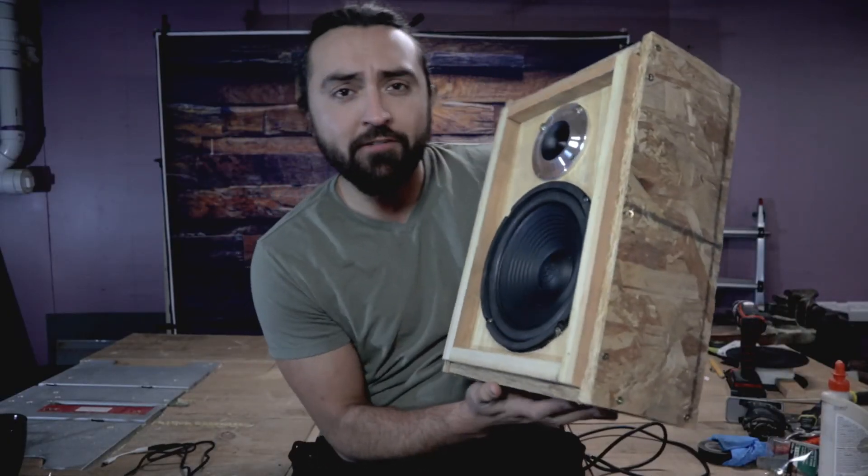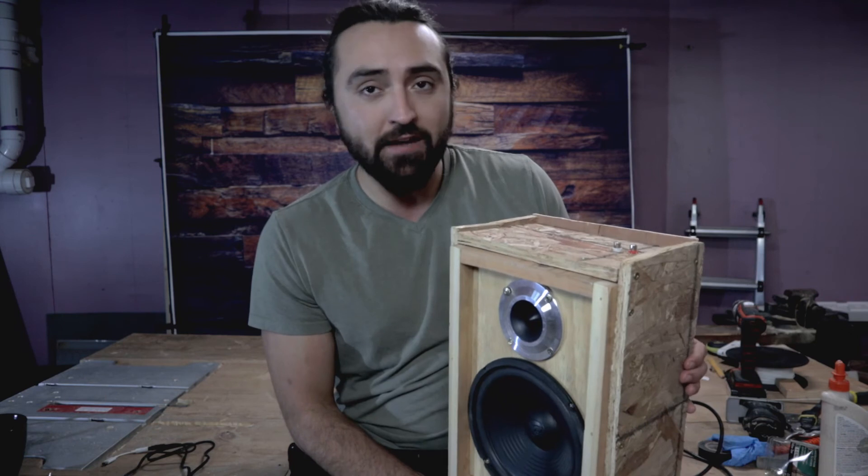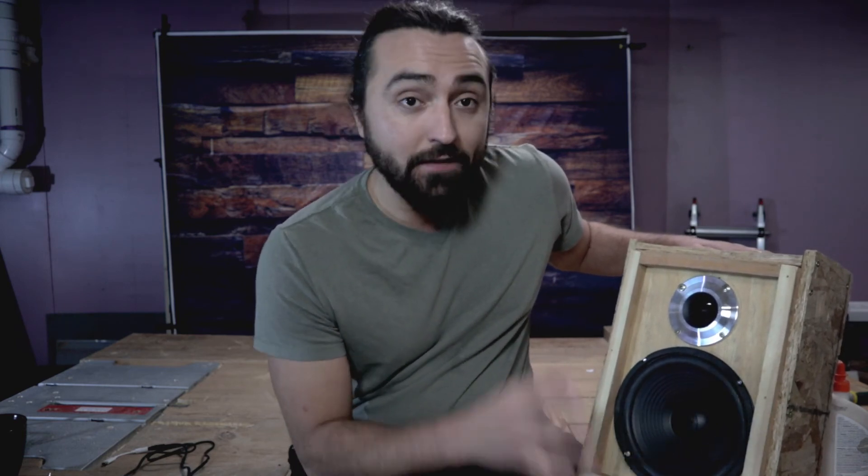Let's go see how the speaker turned out. So, here it is — kind of rough looking, but not bad for cheap speakers and amp. I already had free wood and like a $20 power supply, so I don't have much invested in this at all. I think it's going to put out sound equivalent to one of the nice drum PA systems you can buy on the market. On this amplifier I turned the gain all the way up — in bridge configuration, the RMS output is 90 watts, meaning it'll peak out at around 180–200 watts. I'm not worried about blowing the speakers because their rating is much higher than the amp's peak rating. Maybe I'll have my wife paint it to make it look nicer.